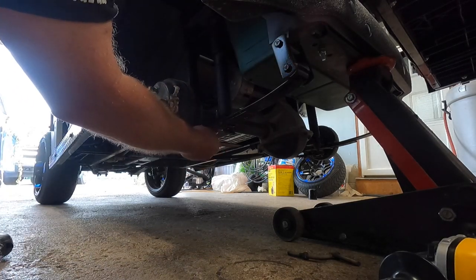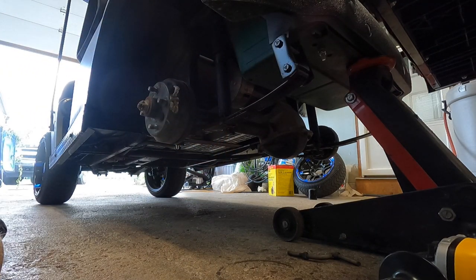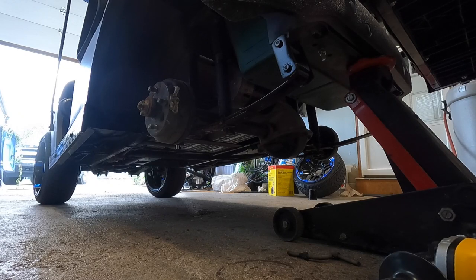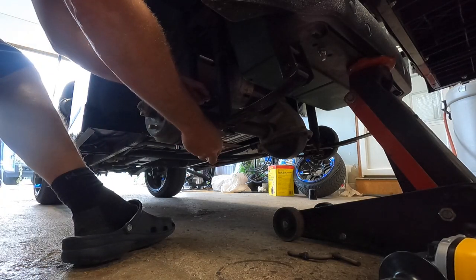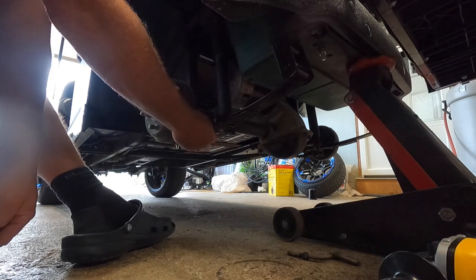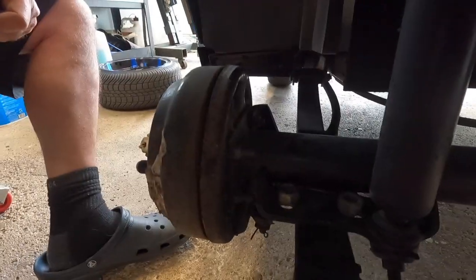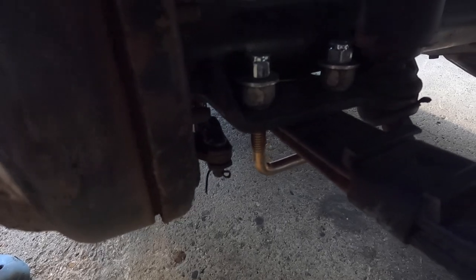Slide this in like so, slide this on here, slide the nut on like so. I don't think I've got enough threads on here - we better put another washer or two on there. I don't have any washers so I've got some lug nuts I'm not going to use anymore - I'll use them now. When fabricating, if you put a bolt that's bigger, a washer, and then the nut, you've got lots to tighten her down with and you don't run out of threads.